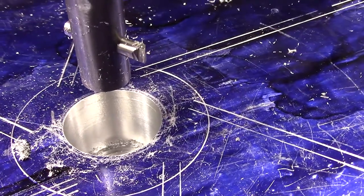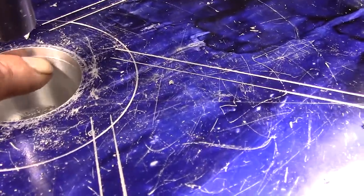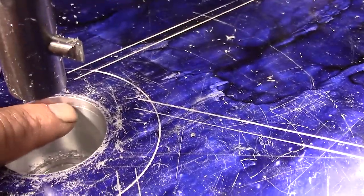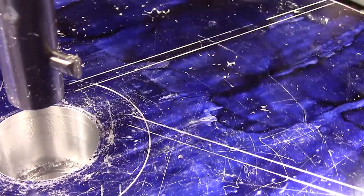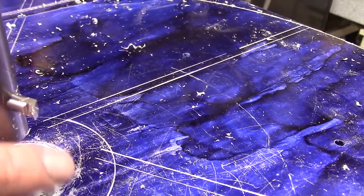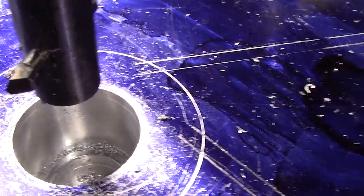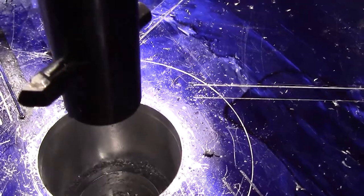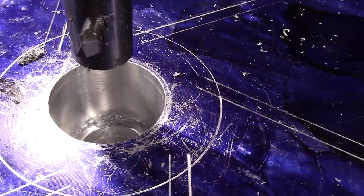Okay, so here's a view of the hole. And you can see really clean. This is my first cut that I cut too wide in here, but you can see the rest of that hole down to the base is just pretty as can be. And this is the little cutter I used right here. My first time making a boring bar, or a fly cutter, whatever you want to call it. I'm not sure what you would call it. I wasn't face milling. I was boring a hole.